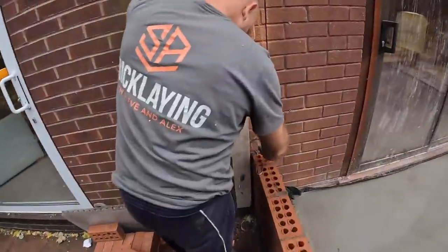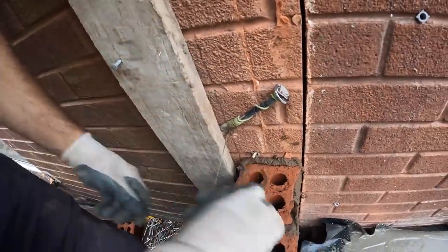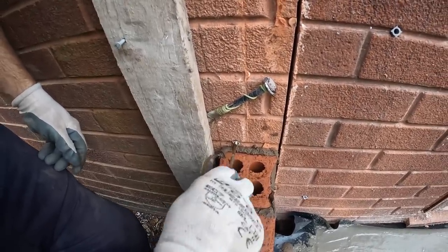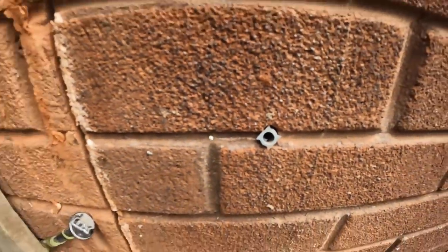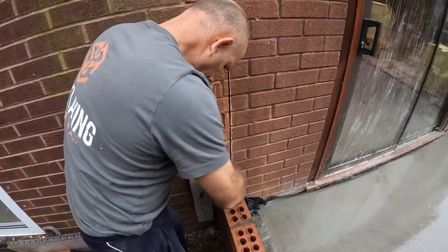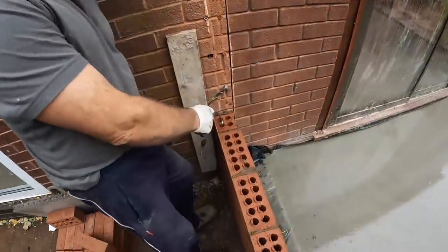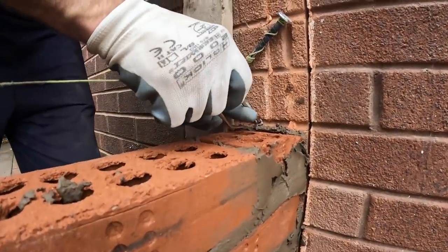Another tie going in to prove to you all that we have ties. The screw-in wall ties going in. These things are solid. Yeah, and the plugs. We've recently got some new plugs, and bloody hell, they work. Really good. You twist them for a little bit, and you think they're not doing anything, then it grips. Do it on an angle, so they're never going to pull out because they're in on an angle. So they go into the brick, not just into the mortar.